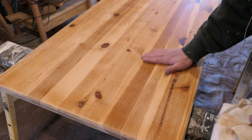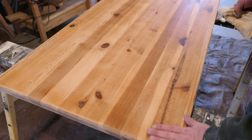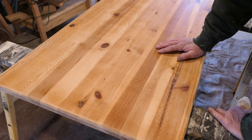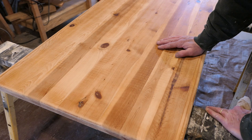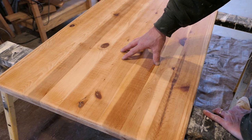After a quick sanding I wiped it down with either alcohol or acetone — that gets some of the dust out and it evaporates very quickly. I did not go crazy with the sanding; you can see there are still imperfections from the original wood. That's fine — this is not supposed to be a very fine piece of furniture; it was a utility table we're repurposing. The next step might be to start working with the stain, but if you have any doubt about the origin of the wood or whether there might be waxes or any kind of impurities, I suggest sealing now with shellac.